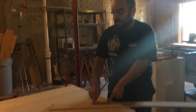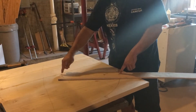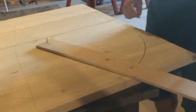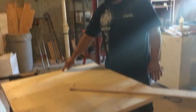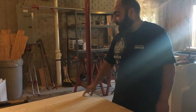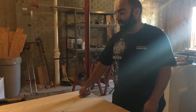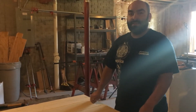Here's the drill hole I drilled for a pencil. Here's my nail. I just set that in the center and then place the pencil in and draw it around. Works very well — makes an easy guide, gives you a nice consistent circle all the way around. I do keep my pencil pretty flat so I get a heavy line, but then I always try to cut just outside the line with a jigsaw, and that allows me to go back and sand or plane off the edges down to the line.